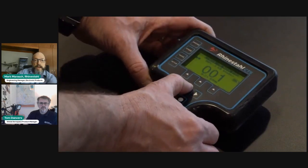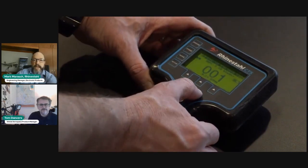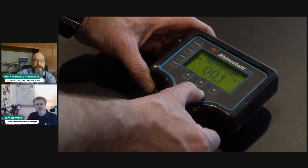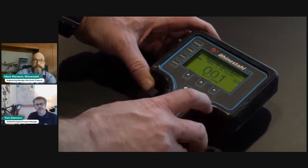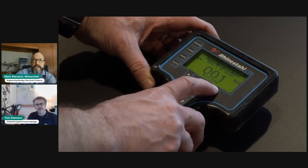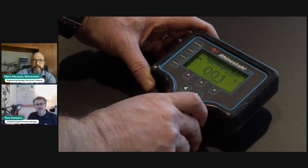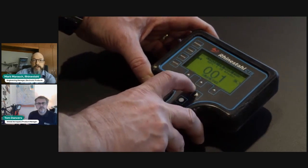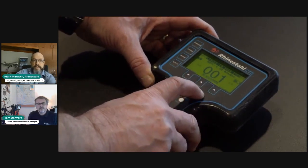So to set up, we first press engine, and use the arrow keys to select the profile of the engine and interface we're using. For an engine that can be turned in both directions, we select backlash. Then we select speed and slow the system down, because it works better if you do this slowly. So we'll select the speed, turn it down, and we go back to backlash.